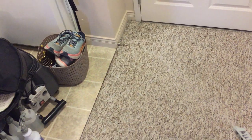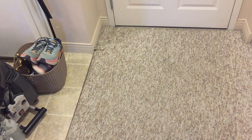When I'm coming in and looking at the job, I do an assessment, and I don't really think of it anymore because I've been doing it for so long, it comes naturally. I'm going to clean this area first with the fiber pad and finish that off, then switch to the Iron Man and clean everything else. Typically I go over the most soiled area first, do the rest of the area, and then come back over the area that was most soiled so that it ends up getting an extra cleaning. Makes sense, right? A little bit of extra, almost automatic, going over the really soiled areas.